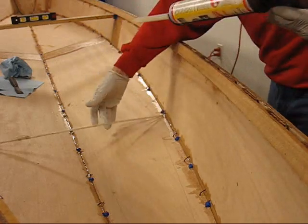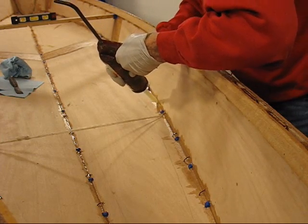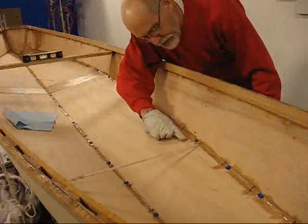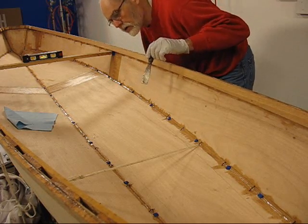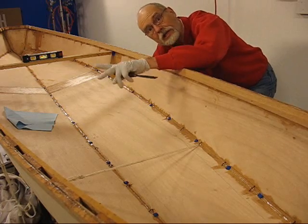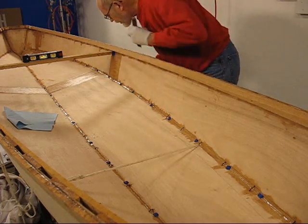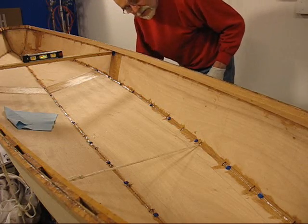I have this Spanish windlass here to keep a little bit of tension on the part to keep the hull from sagging. Come along after to check on how it's puddling up — it tends to flow but not too freely. It tends to puddle in and kind of relax into its position and smooth itself out, but it doesn't want to go running off willy-nilly down the hillside. Come along with your putty knife and clean up any spots you may have dribbled.